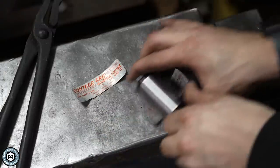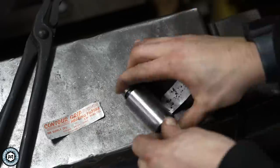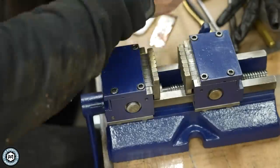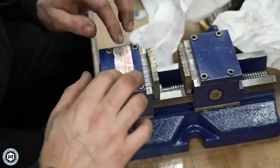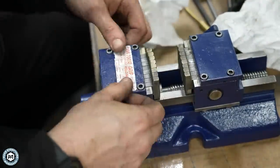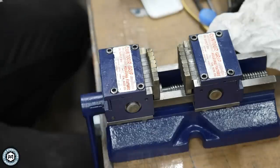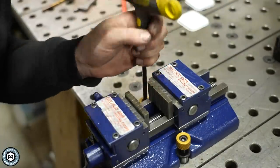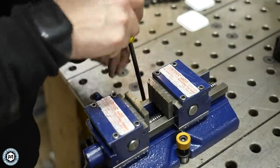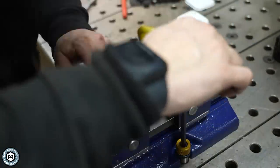The last thing I had to do was try to salvage these decals. I used a metal roller off of my 2x72 grinder to sort of flatten them out, and then I used some rubber cement to glue them on. The adhesion wasn't great, so I'm not sure if they're going to stick around — I might redo them. I can bring it back over to my table and give it a test run. What's really nice is that the whole pattern lines up perfectly with my Strong Hand fixture table — total coincidence.